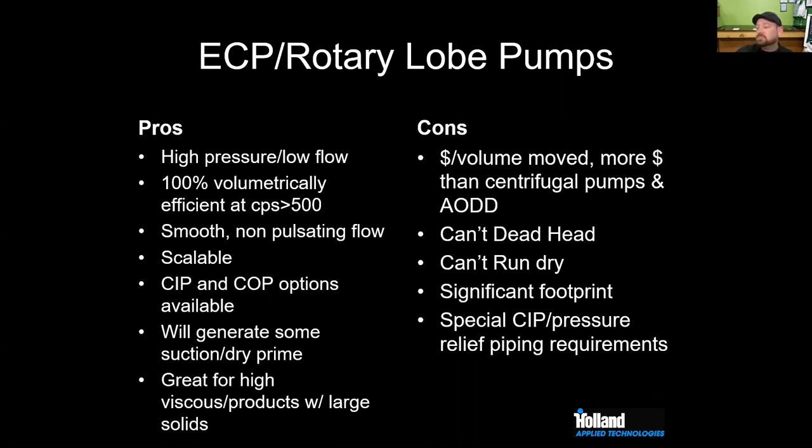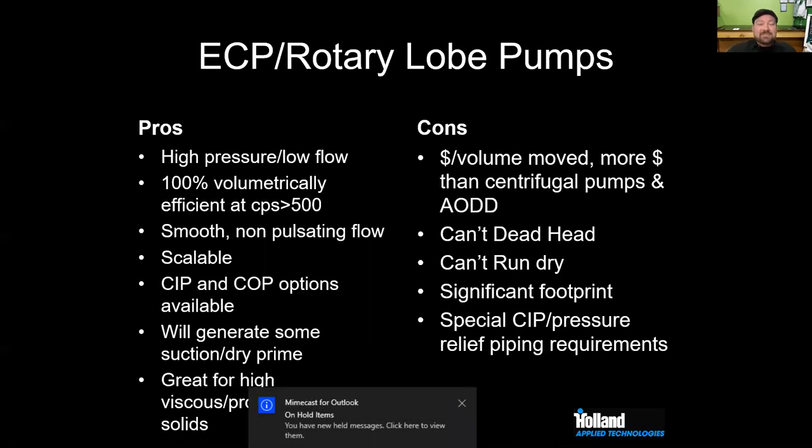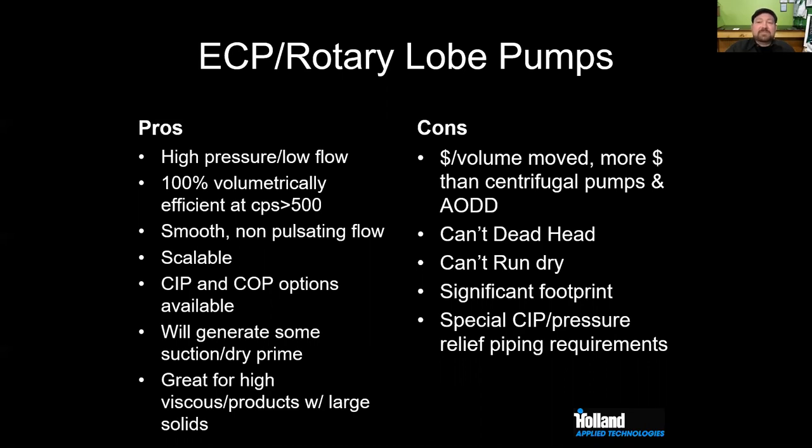So, I told him, yeah, your centrifugal pump could probably handle this heavier glycerin product. It was about 500 centipoise. But I know what you're using, and you're not using an explosion-proof motor. And he goes, well, no, I'm not. And I said, well, you're pumping 80% ethanol. I go, that's not good, right? So you want to be thinking about everything. And of course, he goes, well, I already bought all the ingredients, right? And I just told him, I think the least of your concern is whether or not your pump can handle it. You need to think more about whether you're going to blow yourself up.